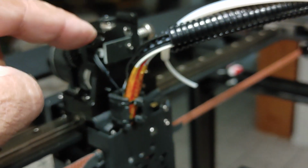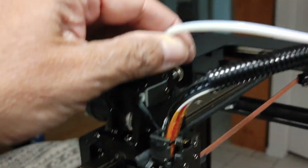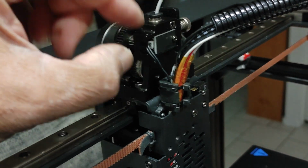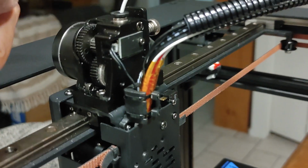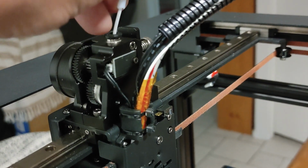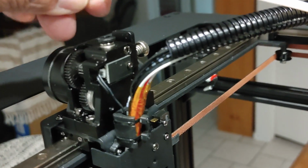Okay, so I put this back together, the feeder mechanism. That's back in place, and that should clear that. This needs to be very, very straight in order to feed into that very high tolerance pass through hole that's inside this mechanism here, because it's very, very tight tolerance, and it's kind of wedged there, so that's got to be precise and nice and straight, otherwise it'll probably get jammed. So that's probably what I think happened. I wasn't aware of that until opening this unit.